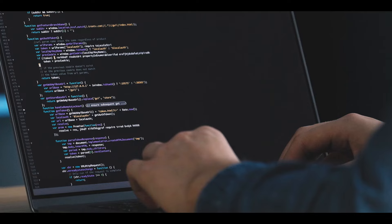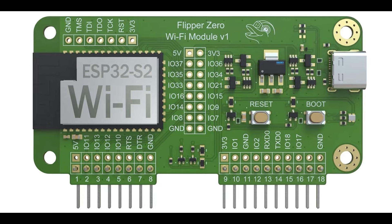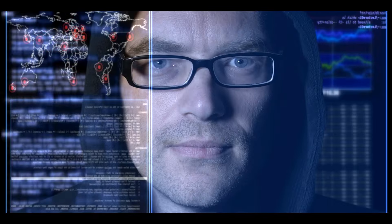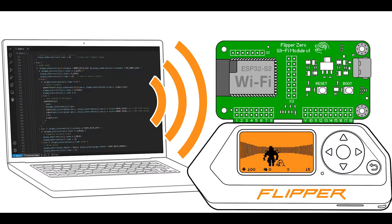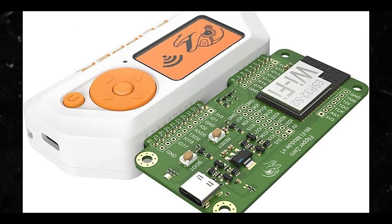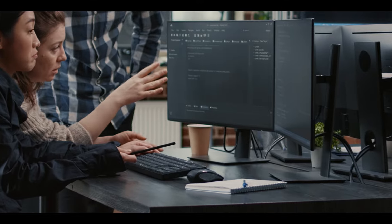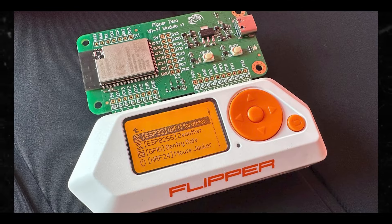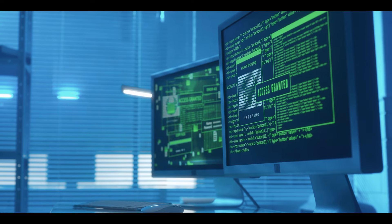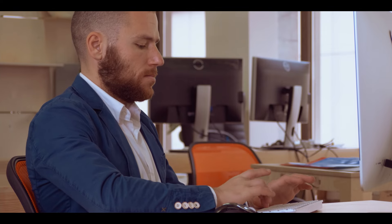Now, can you hack Wi-Fi networks with Flipper Zero? Yes, but not directly. First, you need a Wi-Fi dev board, and then you're going to have to flash the firmware on the Wi-Fi board, install new firmware on the Flipper Zero, figure out what to do when things don't work, and learn how it all works. Then you can run a tool called Wi-Fi Marauder that will give you access to a bunch of wireless tools. There are no shortcuts — every step takes time, learning, and some effort on your part.